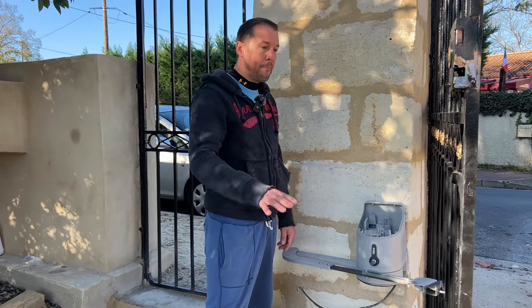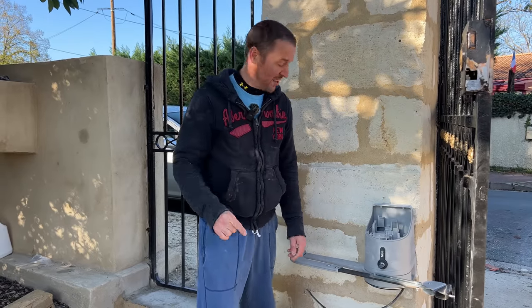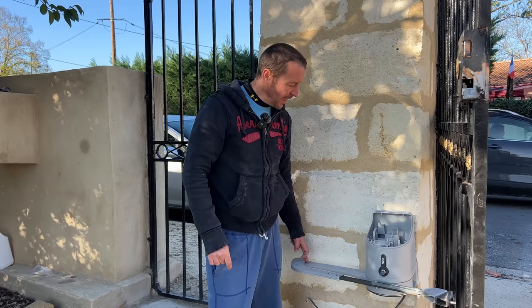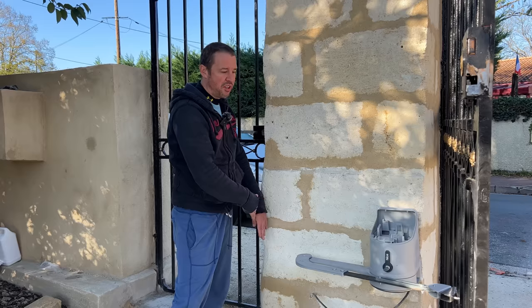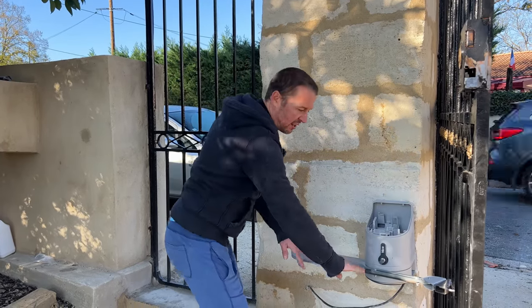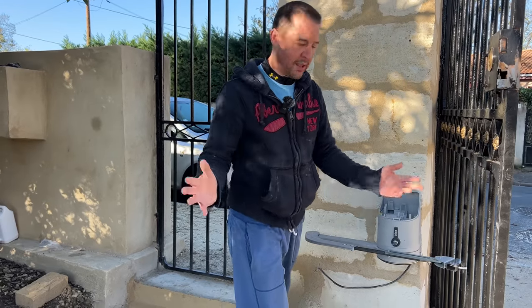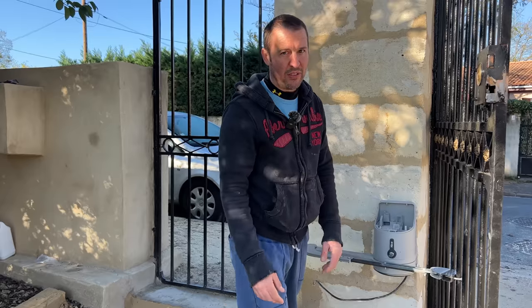Customised it. But there's one thing I couldn't customise, and it's the one thing I needed to customise, which is the length of this bit here to the pivot. If I could make this just a bit longer, or buy a part that's a bit longer, which I might still try and do, this problem here and the gates not opening quite as much as I want will just go away, and I'll be able to open the gates another 10 centimetres, which makes all the difference.